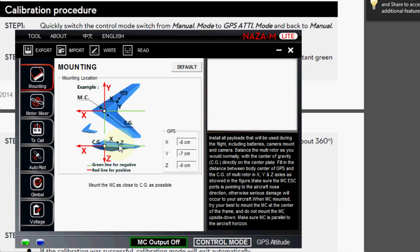Back in the mounting hardware, I wanted to mention that I've got my GPS on a pole mounted on the back left side of my quadcopter, and you'll notice all of these values are negative. You'd think if it's mounted up on a pole above the quadcopter that would be a positive value, but it is negative. On the z-axis, the red line is positive and the green line is negative, so if you're above the aircraft on the green line it'll be negative — z will be like minus nine or minus ten if it's on that little pole.